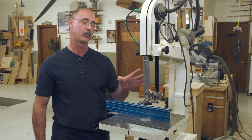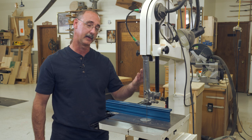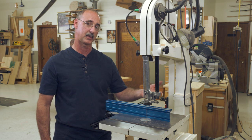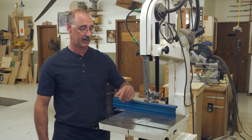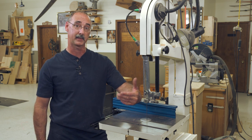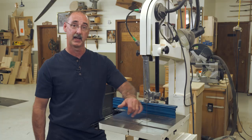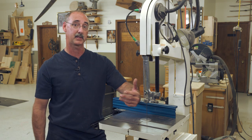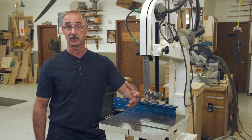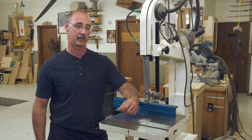This provides a really wonderful way to cut small parts like you would for pen turnings and smaller components. The other thing that's very handy about a band saw is the ability to cut non-ferrous metals. With a fine-tooth blade like I have in here right now, I can cut aluminum, brass, copper — I commonly use those kind of components as decoration for other parts of my woodworking.